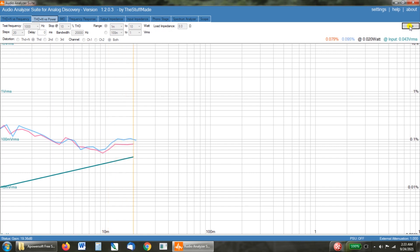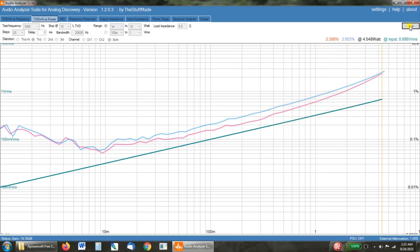At pretty low wattages you can see very low distortion. Coming up to one watt we cross over one percent at about one and a half watts. At two percent we're at about three watts, and right here we're at almost four watts as we're crossing two to three percent. At five watts we're right at three percent, and here's where it starts hard-clipping — on my analog scope at six watts we're at four percent distortion. Down at one percent we're making two watts, so clearly if you're needing two to three watts of power you're going to be under two percent distortion.